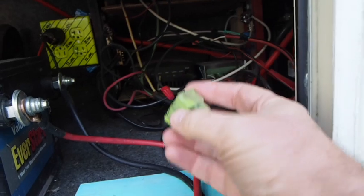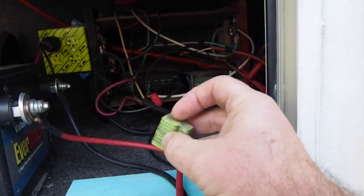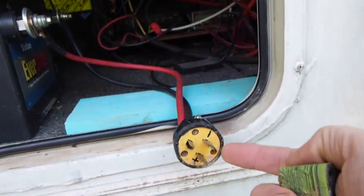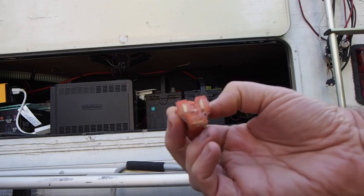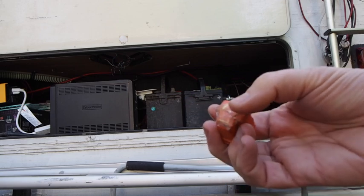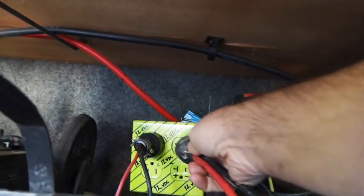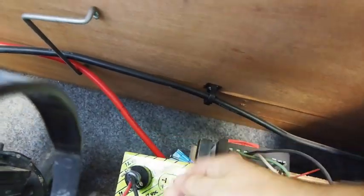I bought several of these adapters for about 97 cents each. I took an angle grinder and cut off the tabs, then put silicone over the top to insulate it so there's no metal exposed. This becomes functionally just a cap I can put onto the plug to shield it from shorting out. On this one, because the silicone is clear and I didn't paint it, you can see I shaved off the tabs that would normally stick out the back and siliconed over them so they're not exposed and not conductive. Now I can just plug it in and it's quickly and easily connected to my battery bank.